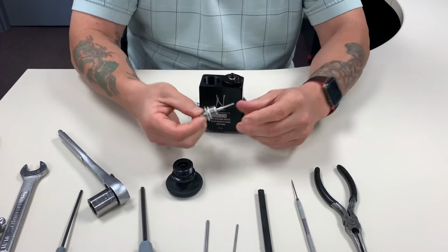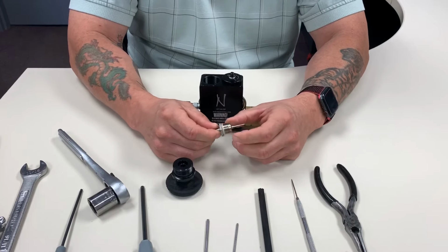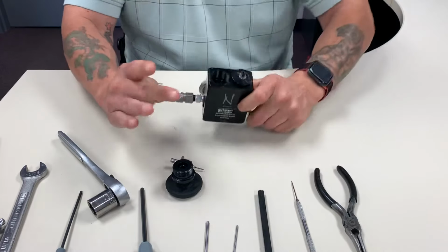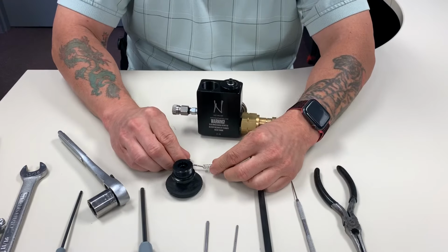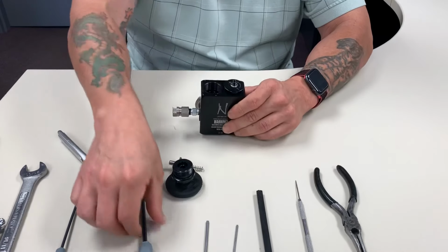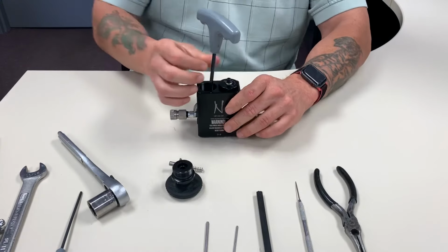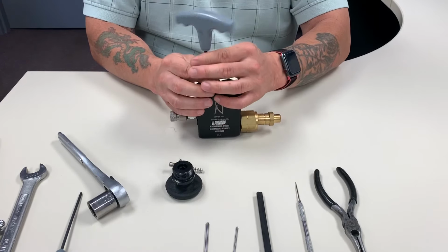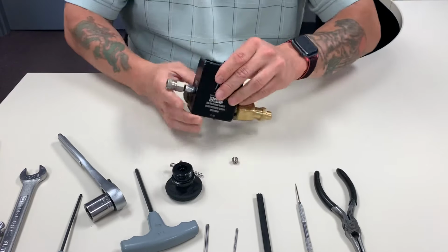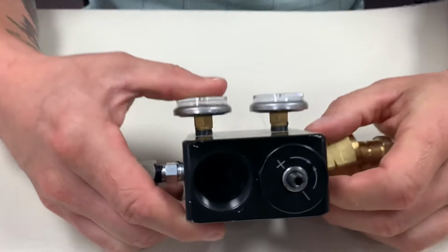So once I get that, once again, this is all one assembly. Don't need to worry about that. This O-ring static really doesn't need much. In here is the spring for it that goes on the shaft. The leaking issues under the jam nut may be difficult to see in there, and that's a 3/16 Allen. So you just got to find where it pops in. Once again, nothing on here is really overly tight or Loctited or torqued. And that comes out. Inside there is a 004 O-ring, and you'll see that in your manual.